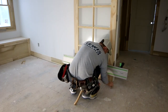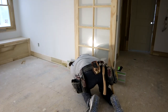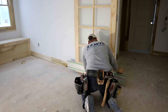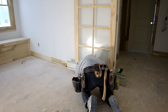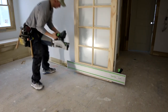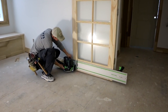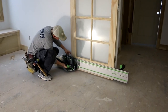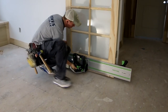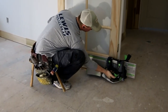Using the gauge block on single doors is not a big deal, but on double doors you really need to be careful to make sure the inside edge of both doors — where they meet in the closed position — is cut evenly across the bottom. Here I'm making sure I'm on my pencil line so that when the doors are shut they're cut to the same length in the middle. This may seem sketchy but it's honestly not too bad. The main thing is your body position — maintain constant pressure between the saw and the guide rail to prevent any jumping as you make the cut.